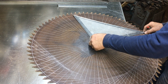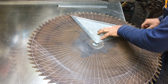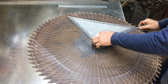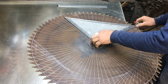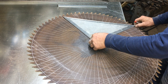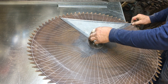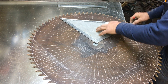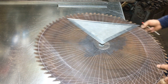Are all these marks absolutely necessary? I would say probably not. Once you get your angles and everything set on the Bell Saw, unless you're really rough on stuff, it shouldn't move. But bear in mind, whenever we were doing this before, we were doing it all freehand, hanging from a chain on top of a wood lathe with the grinding wheel mounted on the lathe. So we had to have these witness marks for every individual tooth, just so you could maintain the semblance of the angle.